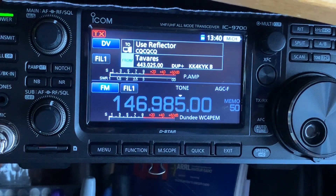This can be done kind of two ways. If you have a GPS receiver unit on it, then you can do it through that. But for a lot of us, like myself, we have this in our shack and there's really no need to have a GPS receiver on it. So we're going to enter the GPS coordinates manually. This is important because that way the near repeater function will work to find your hotspot and the other repeaters locally to you.